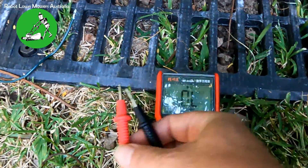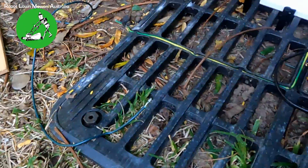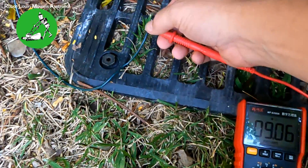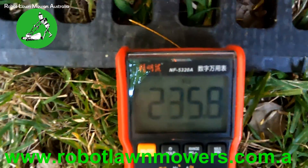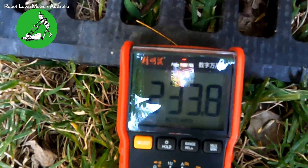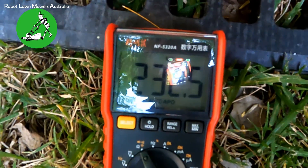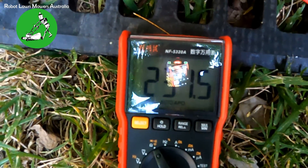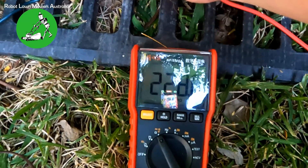What you want to do is connect the multimeter probe to each of the wires. I've connected the black wire to the wire going one way on the loop, and the red wire to the wire going the other way. Looking at the multimeter now — that actually says 234 kΩ, so 234,000 ohms. That 'k' in the top is very important: no 'k' means just ohms, 'm' means mega ohms. Currently reading around 231,000 ohms, which is quite high resistance.